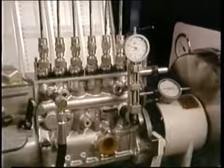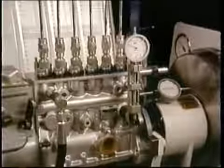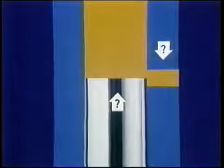Suppose for a given camshaft rotation, you don't yet have port closure. What could you do? In principle, the plunger could be raised or the port could be lowered. In the P pump, you'd lower the port. How would you do that? Under these flanges, a set of shims determine the position of the barrel up or down. When the barrel port is like this in relation to the plunger, that sets up port closure.